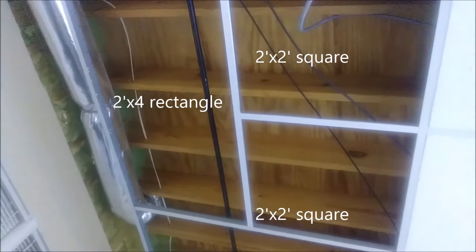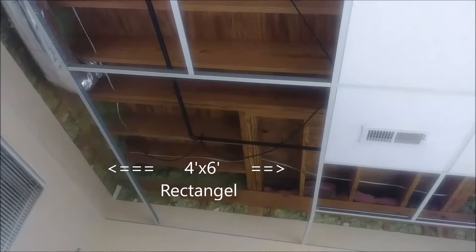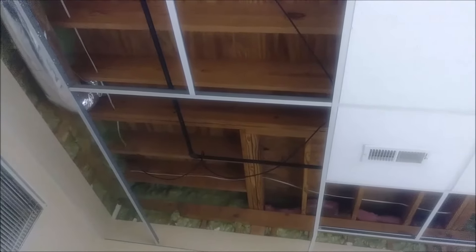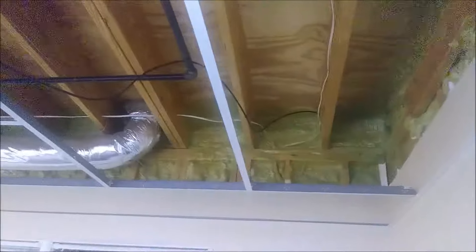This cross-T's curve goes inside and when it connects to the other cross-T you don't see it anymore. So far we have the two squares from before and the four-by-two rectangle for the fluorescent light. Here we have a large rectangle, roughly four by six feet, and we're going to put four-foot cross-Ts on the width and two-foot cross-Ts on the length to create almost six two-by-two rectangles for the tiles.